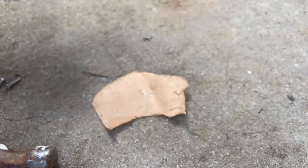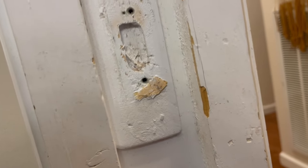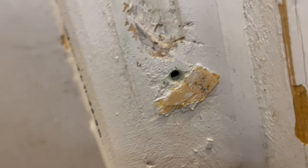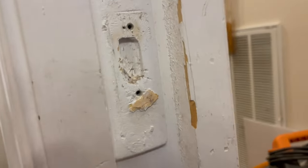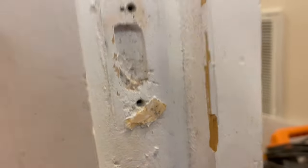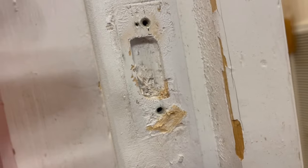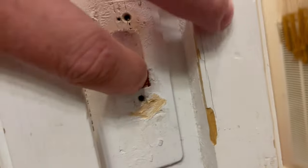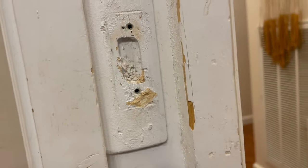Let's go install it. See, I'll show you something else here. Because they didn't want to bang out that dent in this thing and the latch wasn't catching it, they just tried to shim it with a little piece of trash and bring that hardware out. This is like a bad fix followed by another cheese ball fix. Let's go ahead and get that little guy off of there. Okay, that's a little bit better now. At least it's clean. It's all scarred up in there so you can't really see it, but it's much cleaner now. It'll catch. So let me install that plate again.